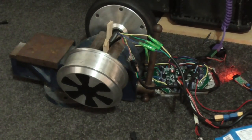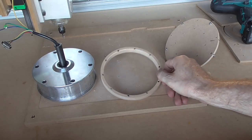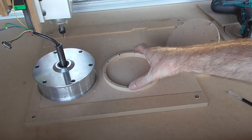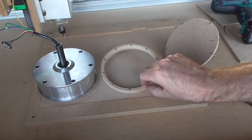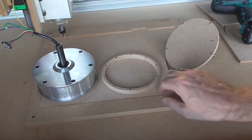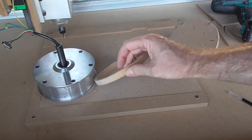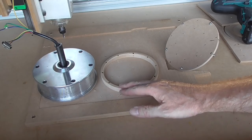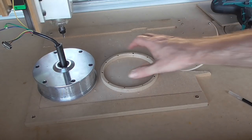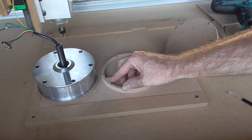We should be using closed-loop mode since these motors have hall sensors. I made two adapter plates out of MDF — it's possible MDF might be sufficient, so I'll try that first and make them from aluminium if they break. This is 12mm MDF and this one needs to be two pieces of 6mm aluminium. This one has a slight bevel that I filed off to match the angled bit on the front of the drill press.